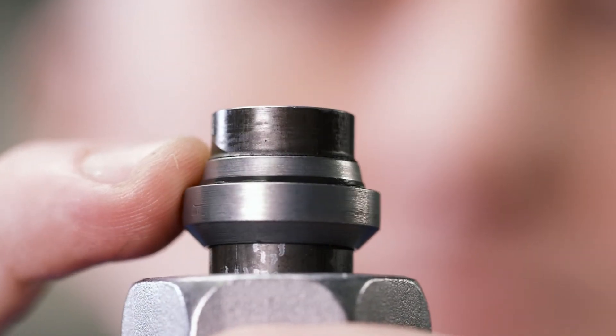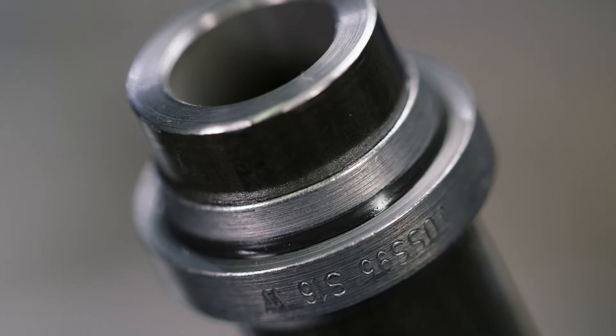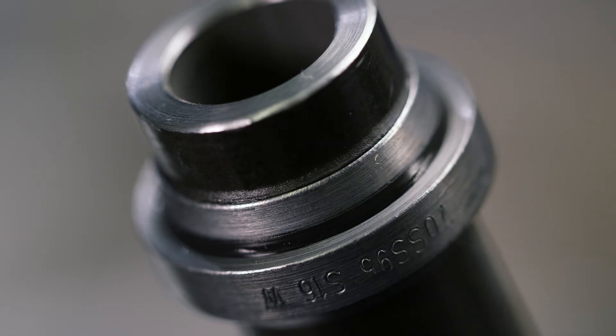The cutting face must be at least 80% covered. The cutting ring is allowed to rotate on the tube. Check the moulded seal for possible damage and replace if necessary. Remove any soiling before final assembly.